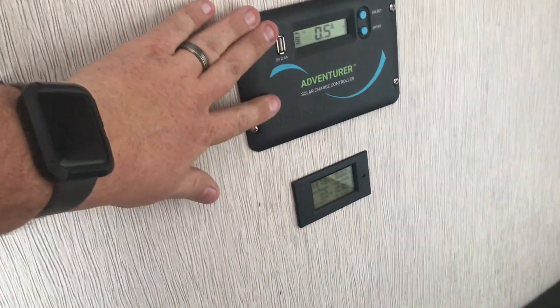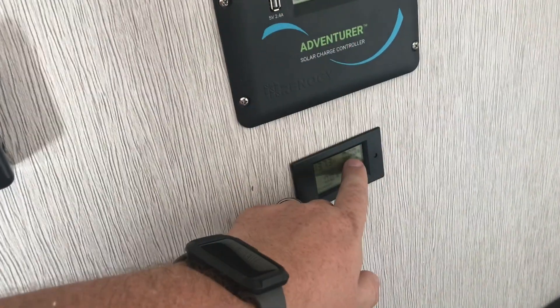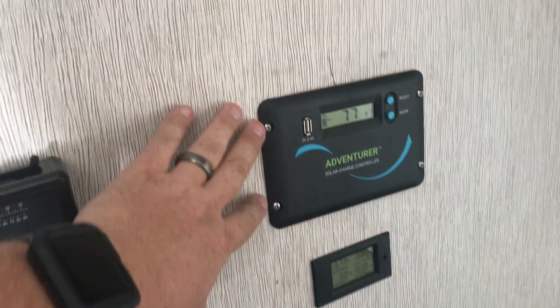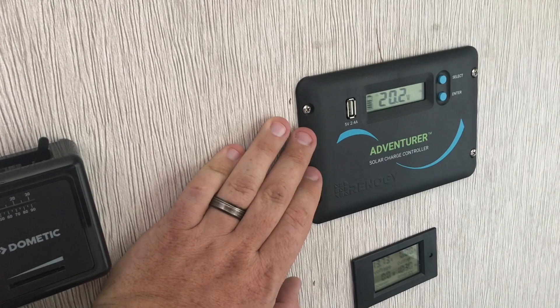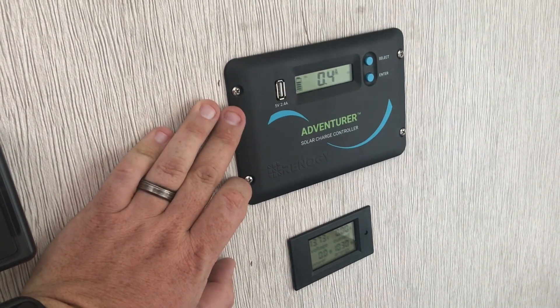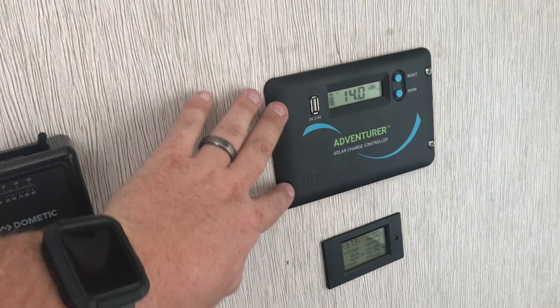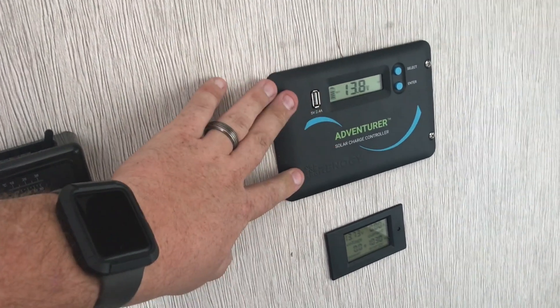For everything else, this is good because I can monitor my charging, and then this monitors my discharging rate. During the daytime you won't see anything because I'm not discharging, but I can monitor my voltages as well. What's really cool is if you get the Bluetooth module for this, it also shows you the current status and history of the unit. It makes it really easy to tell things like your amp hours — how much power it needed to charge the battery all the way back up to capacity. It gives you a nice history.